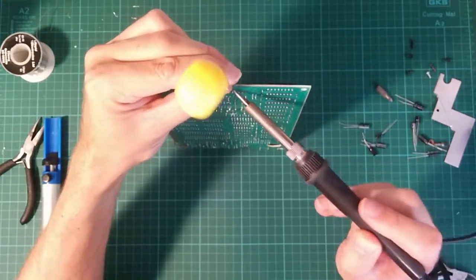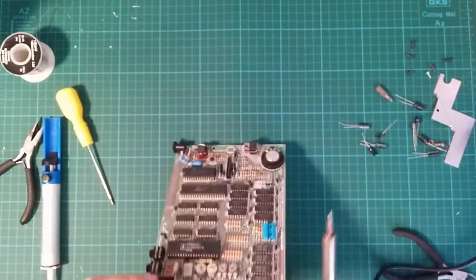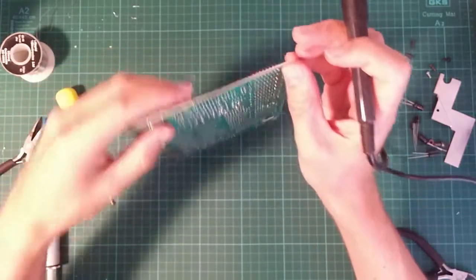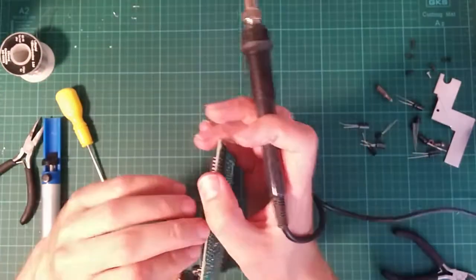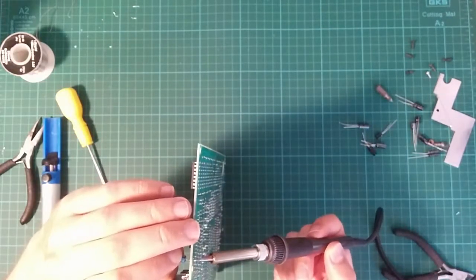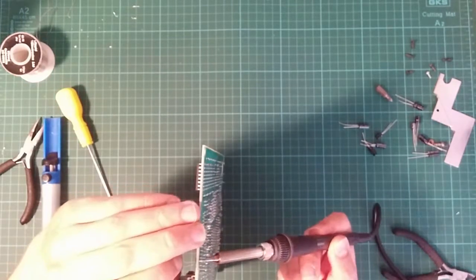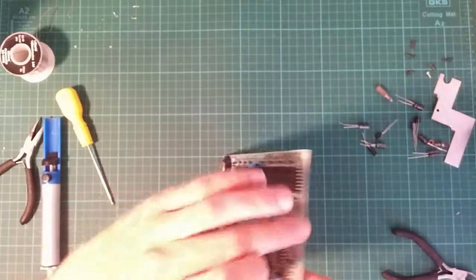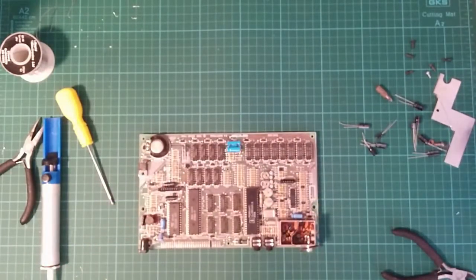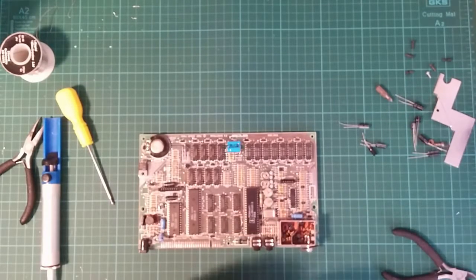It's moving. Out it comes. Polarity check. Negative is pointing at the negative terminal, which is what we like to see. Hot capacitor. Okay, and it is a 22. It is a 22. Good.